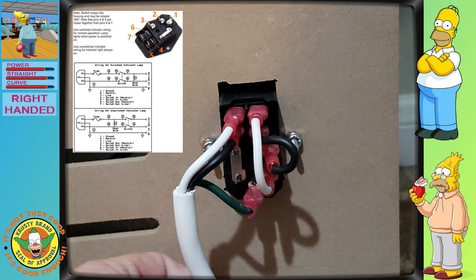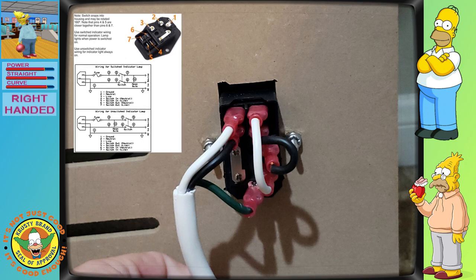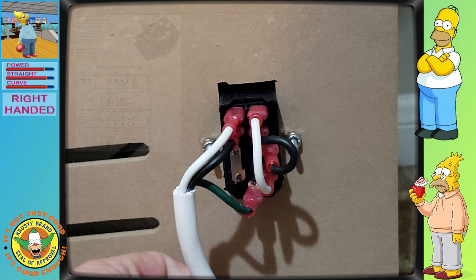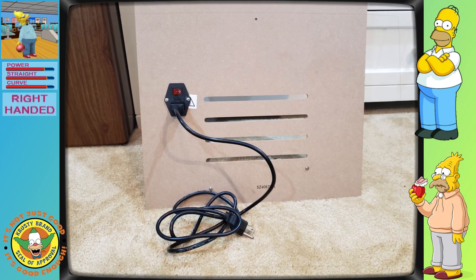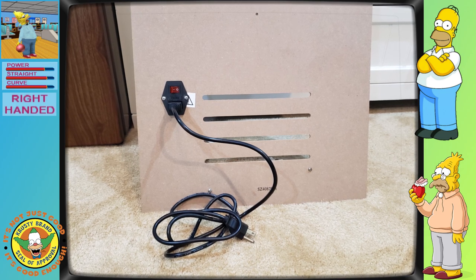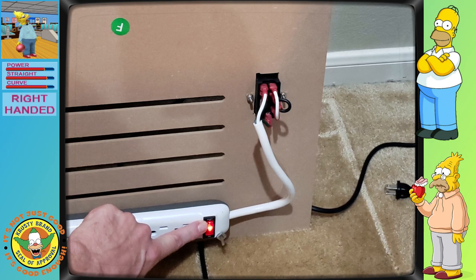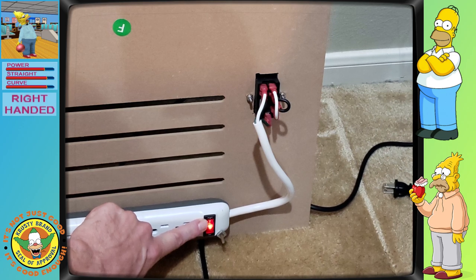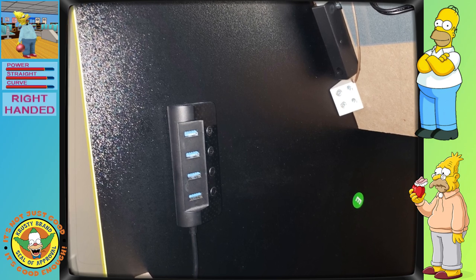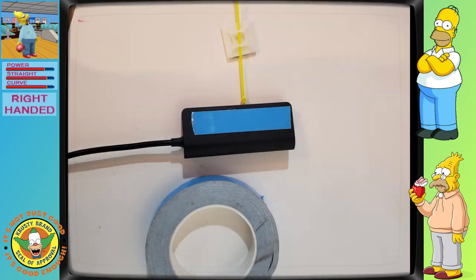Making these connections is very easy, and because of this mod, I can plug in a charger, keeping me safe from the low battery bug, and I can add items like USB hubs without having cabling run out the back. When done correctly, you should have a clean-looking inlet switch on the back of your cab, and on the inside, you should have a hardwired and hard-mounted power strip. All of the switches on both the power strip and the inlet switch should be in working order, and you're now ready to plug in your cab, your charger, your USB hub, or anything else you wish to add to your cab. I personally will be using a USB hub that has a built-in charger, and I'll be mounting this hub with double-sided thermal tape. I've used this thermal tape before on Pi builds to hold passive coolant mediums like copper heat sinks, and it's worked well for me in the past.